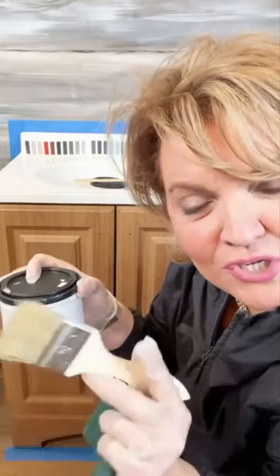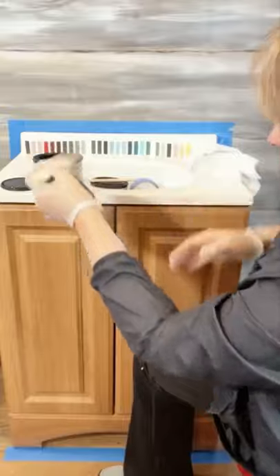We're using our Surface Prep De-Glosser, and I'm going to show you the great way to get your cabinet ready to paint or your piece of furniture. It's fantastic for cleaning away grease and oils and stubborn things that you can't get off of your cabinets. No smell and all water-soluble products that we're using here today. This is going to etch the surface and is going to hold and bond, giving you an extreme durable surface.